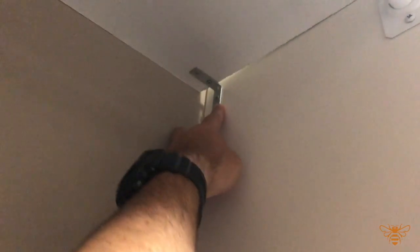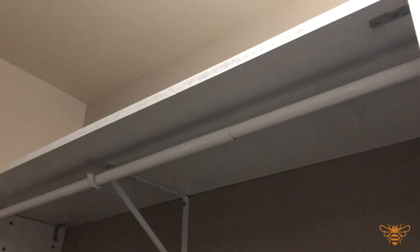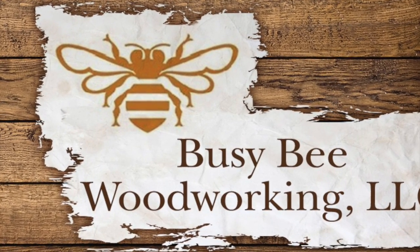The last thing I added was another bracket back here — you can see I made an angle cut. I tried to estimate it; I could have gotten it more exact since this is not completely on a 90, but I cut on a slight angle to make the shelf fit. It's holding up and can hold pretty good weight. If there's going to be a lot of weight on the shelf, I could have added a strip across the back portion and put that into some studs. But it looks pretty good and it's ready for storage up top and to hang some more stuff.